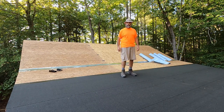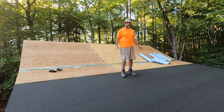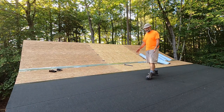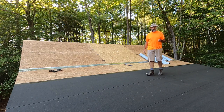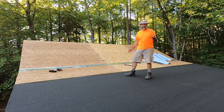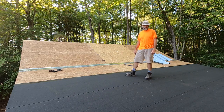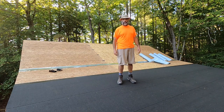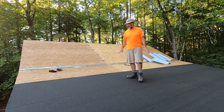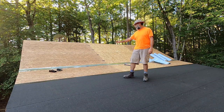Today is about 80 degrees. In cold weather it could be more stubborn, but I would not want to be doing this in really hot temperatures either — 80 degrees works really nicely. Super easy to put down, got a nice straight row with no bubbles. They recommend coming back with a weighted roller to roll this down. I don't own a roller, but I have some heavy rolls of roofing felt, so I'll just roll those back and forth a few times to increase adhesive contact. That's going to do it for today — I'll finish just past that pitch transition fairing and call it a day. Thanks for watching.